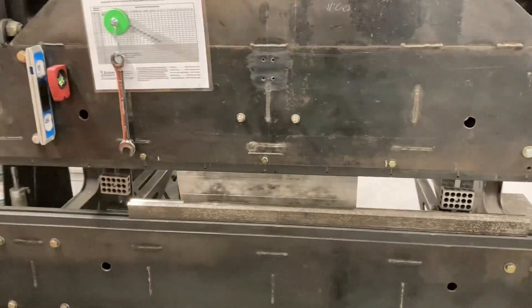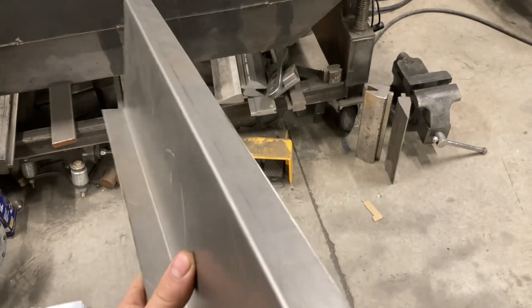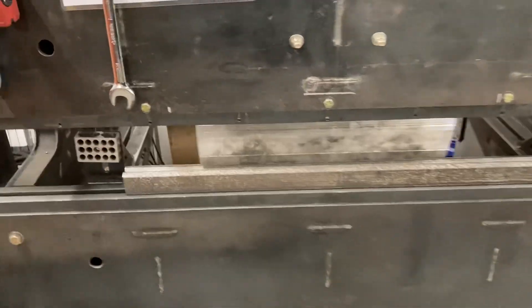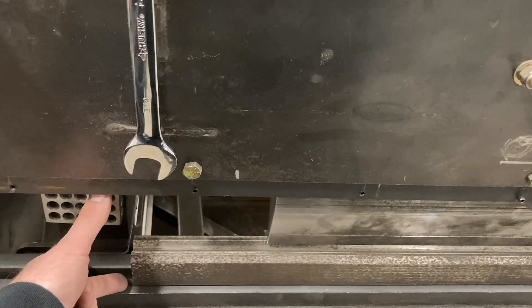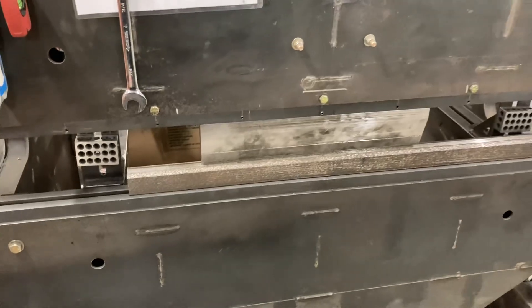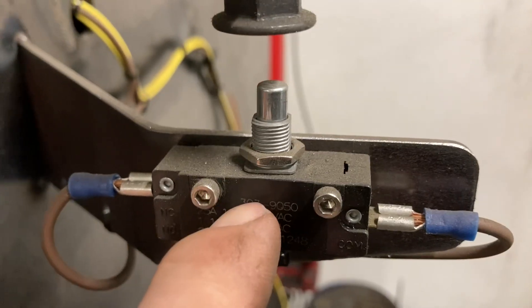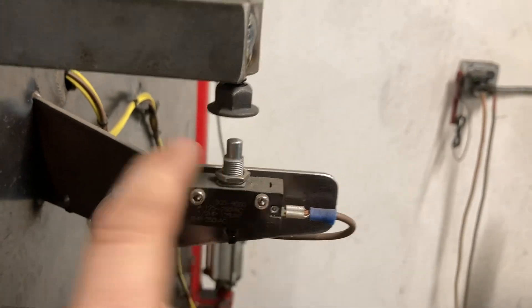That's how I set this thing up. It's a little finicky in the first part to get all your angles perfect, but like I showed in that last video, once it's set it holds that tolerance — it holds a really tight tolerance. I have run it a couple of times with a dial indicator in here from part to part, and two thousandths seems to be the number. It really stays within a two thousandths range. Pretty darn good. These are just some switches I found — I have no idea what their accuracy or repeatability is, but it seems to be good enough.